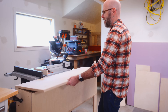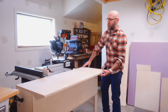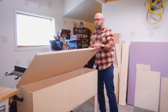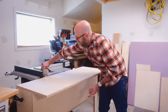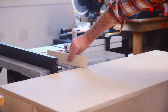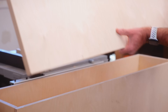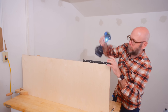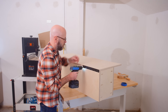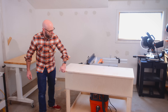Because this whole stand is 48 inches wide — the width of a piece of plywood — this scrap is the perfect width and it's going to make a great outfeed table that overhangs. It's going to hinge on the back so it opens up to access the storage. And if I want to push this up against the wall, I can hinge it up to make it take up less footprint. I'm adding a piano hinge — one on this side and one on the other side as well.